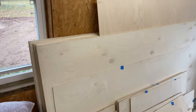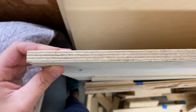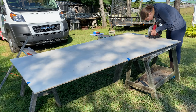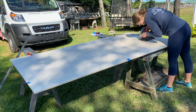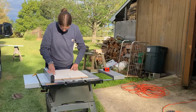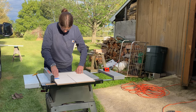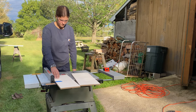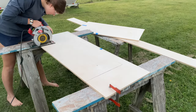For the bed area I am using half-inch Baltic birch plywood which is strong and durable due to its multiple layers of wood. This sheet consists of nine layers whereas other plywoods usually have three. Although cabinetry is generally built with three-quarter-inch material, I decided to use half-inch to save on weight and money. I'd recommend cutting all the pieces necessary for a section at the same time so you don't need to adjust the table saw multiple times and you can be sure everything will be cut to the same dimension. Focusing on one task at a time before moving on will make the process go by a lot quicker.